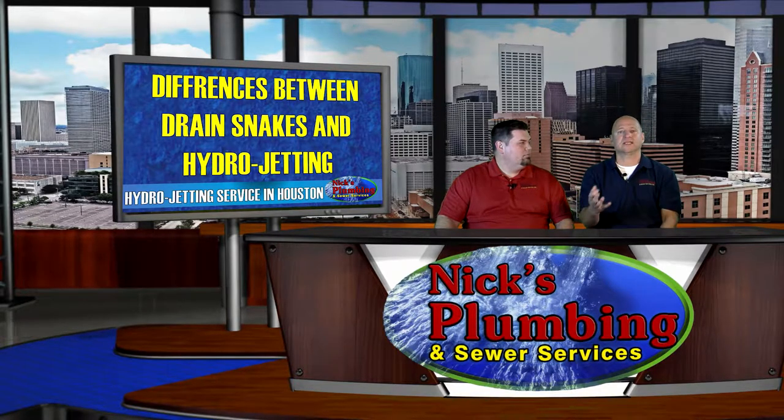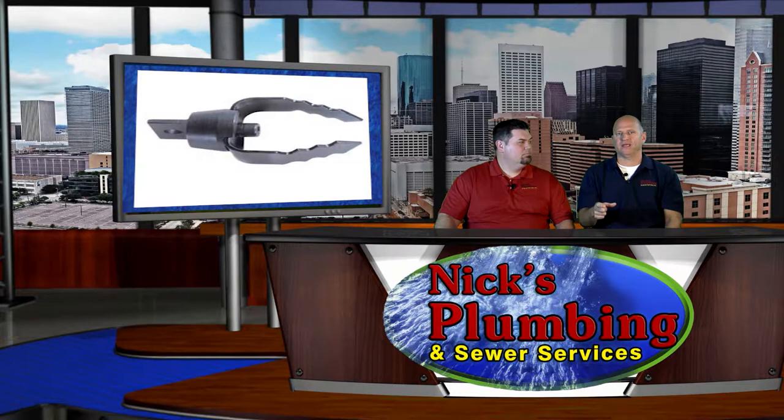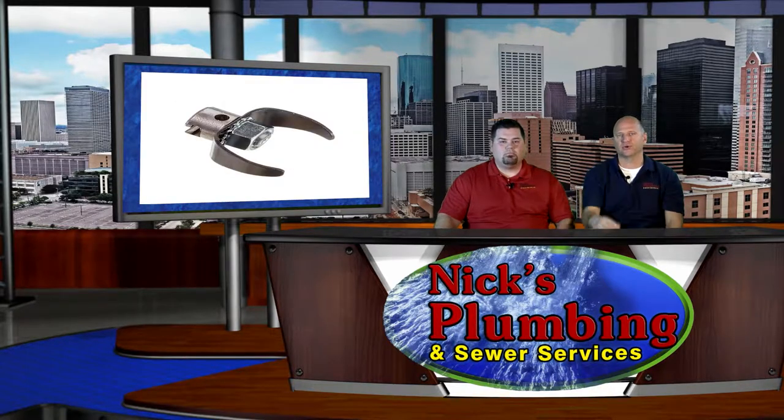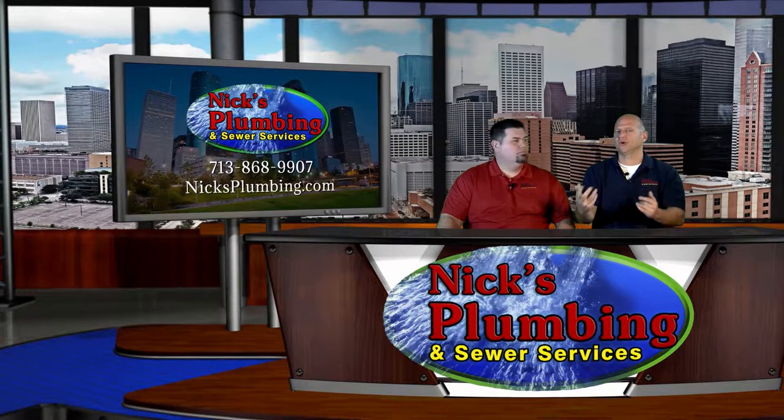Your drain cable — exactly what you said — that's a cable. It goes on a machine with high torque, so you're running a cable through your drain. There are different heads we can put on that cable for different tasks, but the most common one is called a root cutter. It's kind of U-shaped, and it grabs anything in that pipe and wraps it up or cuts it so you can pull it back out or free it up so it can flow through. It's great for stoppages when you don't know what's stopping the pipe up.